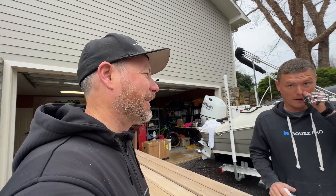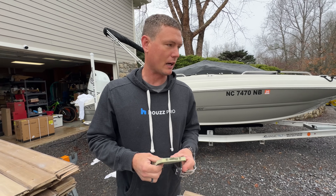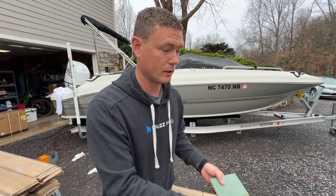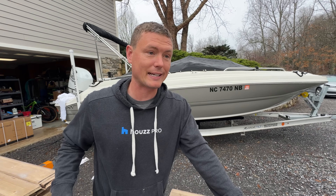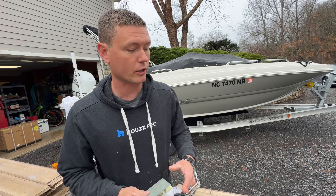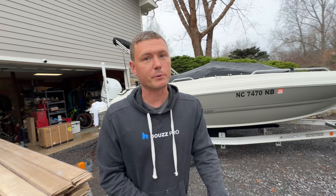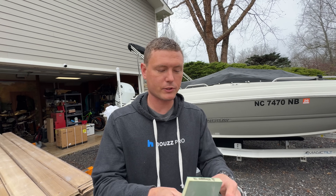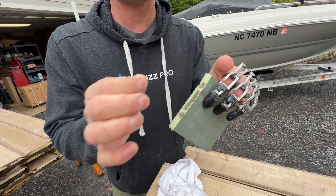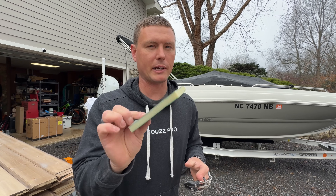Now I want to show you my sanding process. Ray noticed that when we use a hard sanding block we actually sanded through some of the raised grain and made white-looking spots where the stain sanded off. If you're going for a more premium job, you might stain it again. We switched from a harder sanding block to these really spongy ones — I buy these from Klingspor. We're not sponsored by them, but I like their sanding sponges because they're so squishy. They don't cut through all of the polyurethane back to wood, and you can get them in every kind of grit you can imagine.